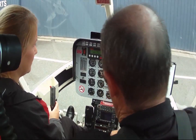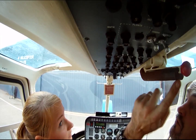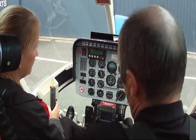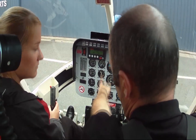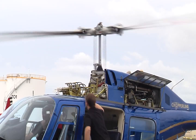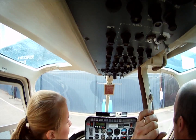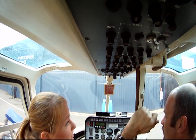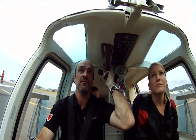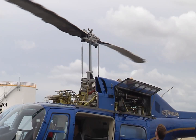We're going to wind it down nice. After fire, so be it — start the relight, finger on the starter. They say igniter circuit breaker — I don't think that's relevant. It's already running, who cares, the igniter's going. You can put your finger back on the starter. So the motor brakes as soon as it moves. You always pull these on full — same as the 120, pull it on full and when it slows down then start to release it with the controller.